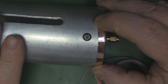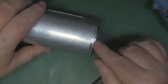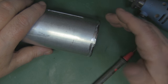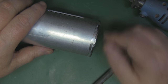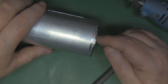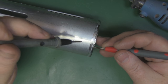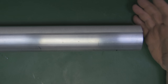I'll probably put paint around the bottom as well, similar to the 5.8 gigahertz version, because I'm going to make a sleeve to go over one side so we can have a directional antenna as well as an omnidirectional. The end cap is fitted to the top and I've used the sanding drum on the dremel to smooth it off for a nicer finish. Important note: don't spread super glue continuously or it forms a barrier — always double check with a continuity meter to confirm you have a good connection with the rest of the tube.